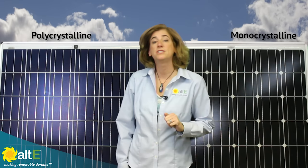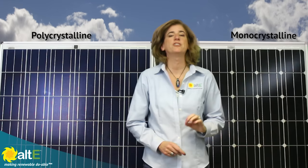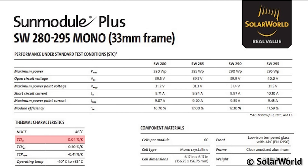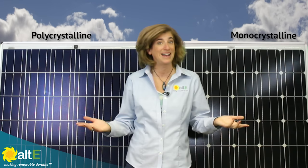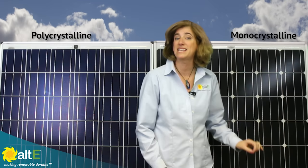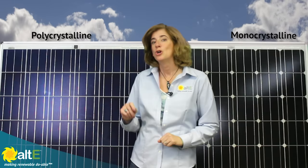One performance difference is how they react to temperature. Monocrystalline panels handle the heat slightly better than polycrystalline. Comparing the temperature coefficient of the two types shows that monocrystalline short circuit current drops 0.04% for every degree Kelvin over standard test conditions of 25 degrees Celsius, or 77 degrees Fahrenheit. So if it's 20 degrees hotter on the roof than in the test suite — which is highly likely in the summer — the monocrystalline solar panel can lose 0.06 amps out of a rated 8 amps. For polycrystalline, it loses 0.051%, equaling 0.08 amps. So the difference is 2 one-hundredths of an amp.